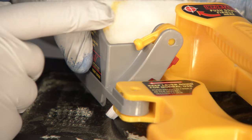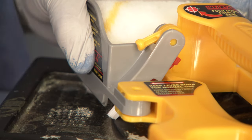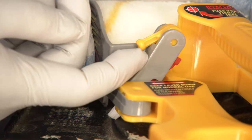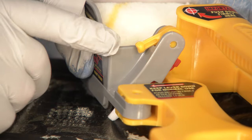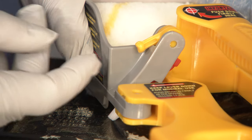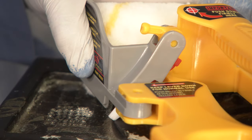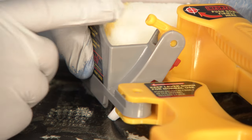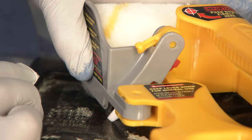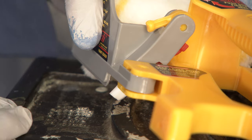On the MX and the XT, we have the brush adjuster lever right here. If you're painting along and you see that the brush isn't quite getting as close to the edge of the trim as you want it to, take this little brush adjuster lever. Start with it in the down position. If you notice the line isn't close enough, lift it up a little and paint more. If it's still not the way you like it, lift it up even more. When you want to push it back in, move the lever back to the down position and gently push the brush all the way back into the socket.